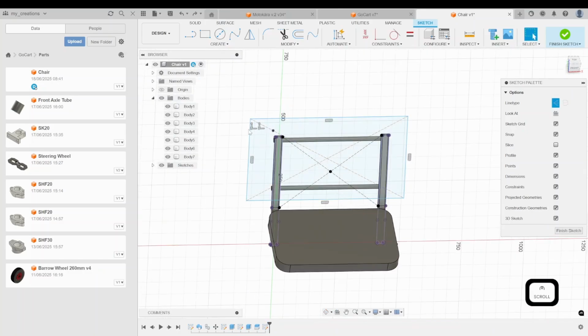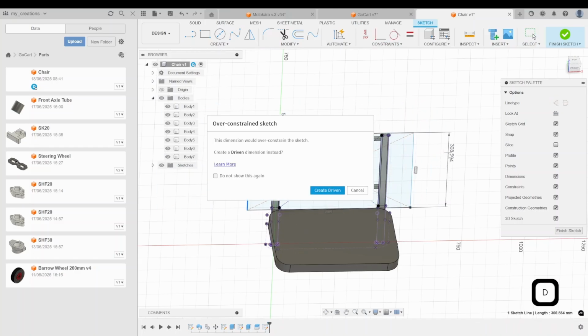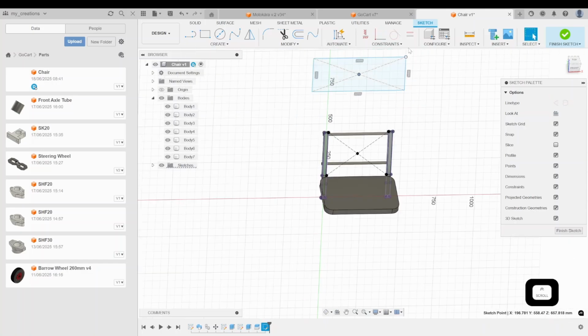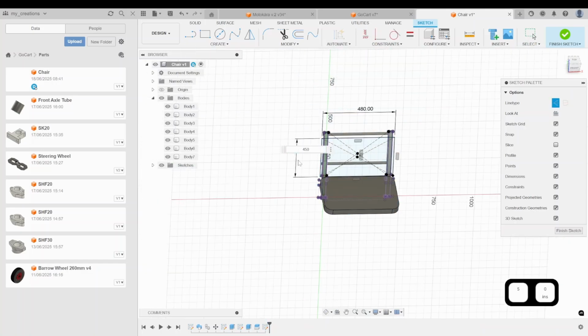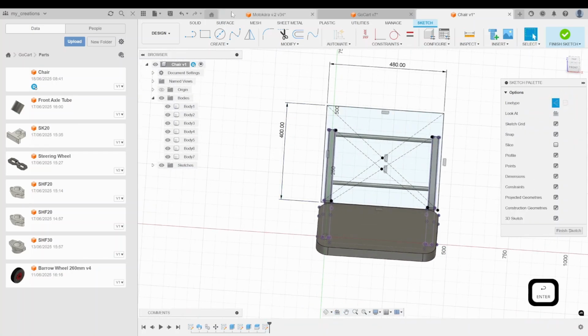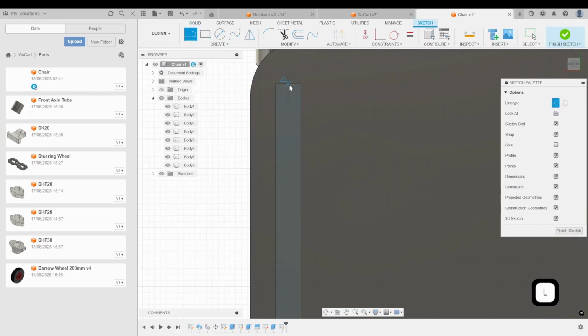I did this because on what was originally the bottom part, but now serves as the backrest, there are steel tubes. These tubes will be useful for attaching other parts of the go-kart, such as the seat mount, the throttle lever for pressing the drill trigger, or the spring attachment for the lever. I'll show you all of that in the next video. So, that's all for the chair design.